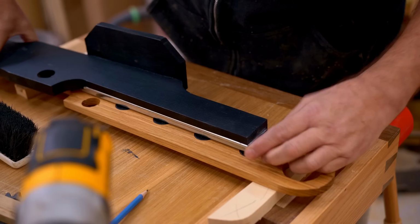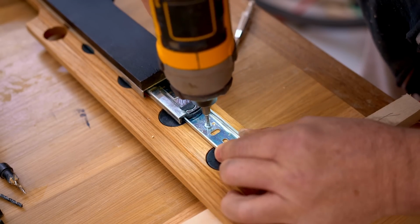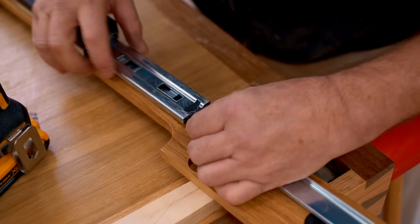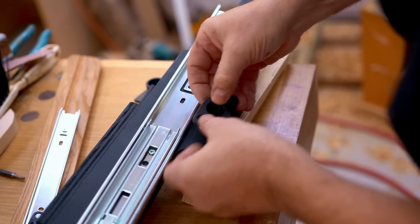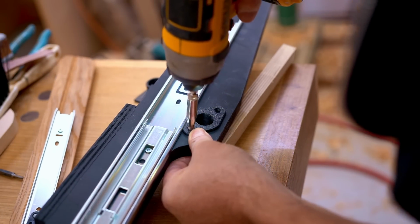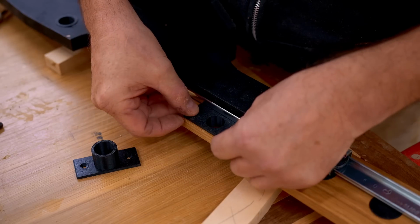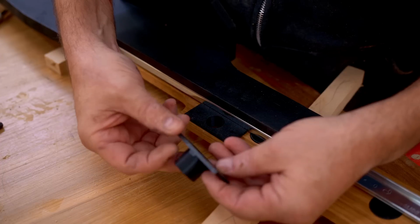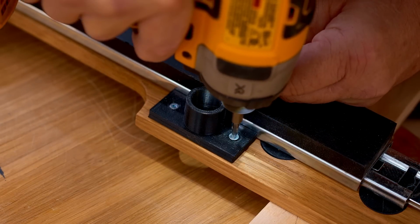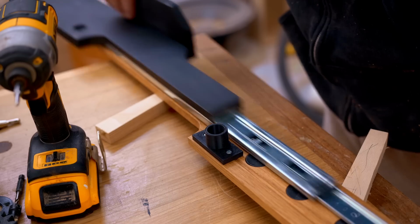The drawer slide back in, get it fastened to the strut that projects out. And get some other parts that I printed put in. This is a bushing for that shaft that goes across. And this one is for the drive axle that links the bigger gear on one side to the smaller gear on the other. And as you can see, all of this clears nicely.